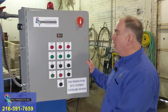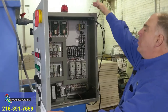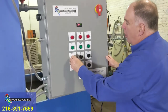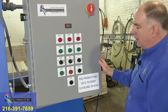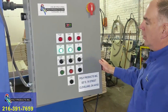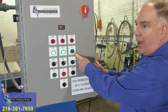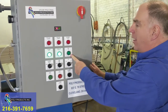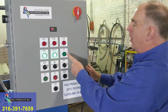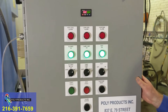Under normal situations, you just want to turn the system on and run it in automatic mode. We are in test mode so the leads are not permanently mounted. Here we have the power switch — it should be in the on position. All of the individual control switches should be set to auto or on. If everything is okay when we hit system start, the system will start. The burner is not active yet — it takes a moment to purge air out of the burner system and then it's going to start the ignition process. Once we have confirmation that the burner is active, that light will go on. It takes about 30 seconds. Burner is now active.